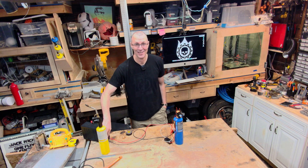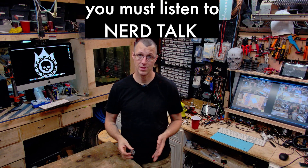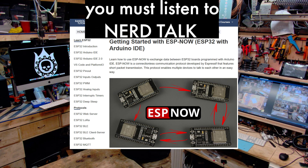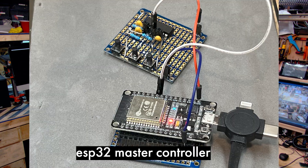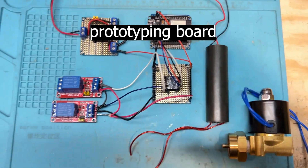I tested this first because I didn't want to be disappointed, but I'm still kind of glowing. I think the principle works, but I need a way to control six of these. I like using ESP32 chips because you can program them with the Arduino interface, and there's even a library called ESP-NOW where you have one master chip that talks to six voluntary helper chips. One chip can send information over Wi-Fi telling six different chips what to do.